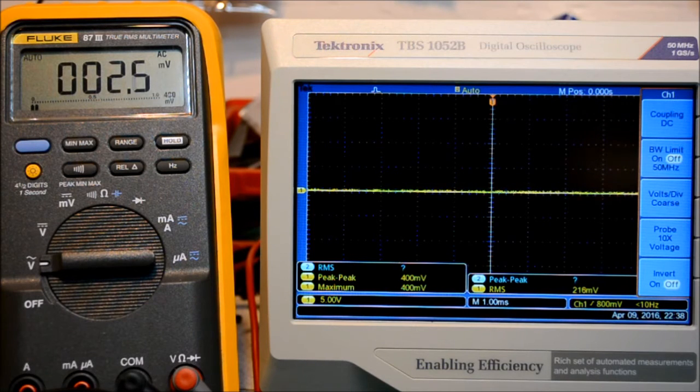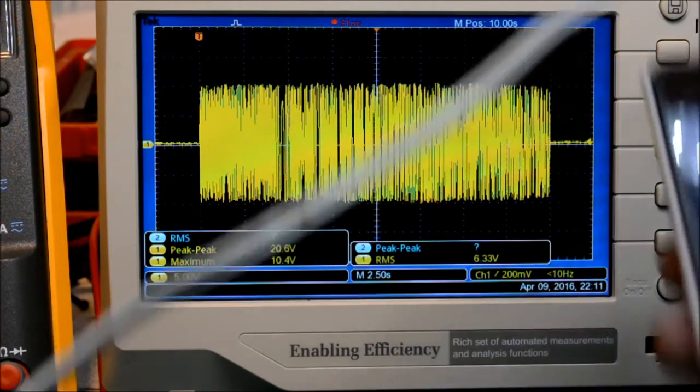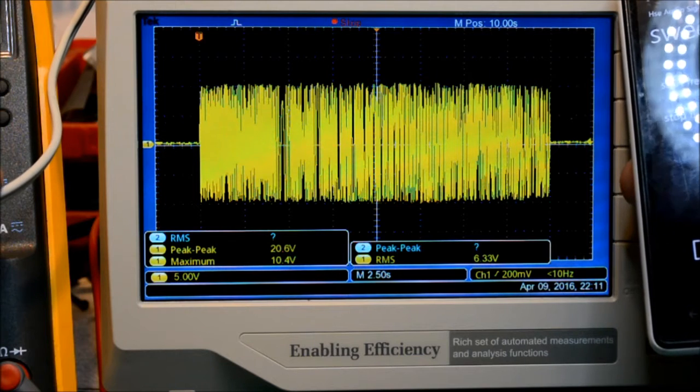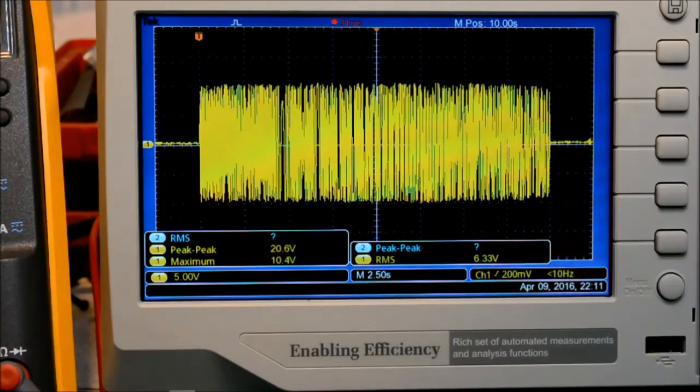In the meantime I've decided not to use Bluetooth because I saw some issues with high-frequency distortion and frequency response on this particular module. So now it's a wired connection into the module. I've configured a sweep from 20 Hz to 20 kilohertz using a signal generator app on my Lumia 820. As you can see, the frequency response is essentially flat — it looks good.